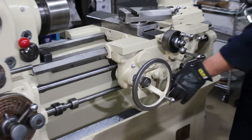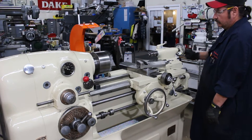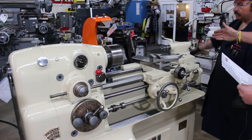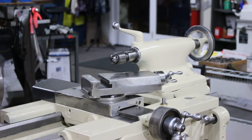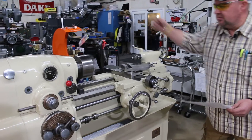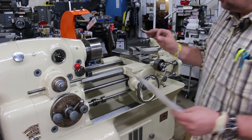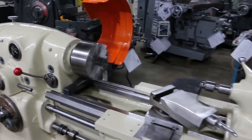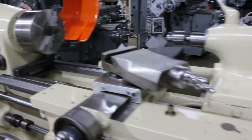Engaging the apron. Engaging the cross slide. Reverse — that's reverse. The tailstock that we're focusing in on right now has a very nice setup on it. It's a heavy-duty tailstock, a heavy-duty wide carriage apron setup. You can tell the sound of this Monarch 10EE is just fantastic. It also has the chuck guard that comes down and a built-in chip pan. The overall weight on a machine of this nature is 2,500 pounds. On a 12½ inch swing by 20 inch between centers, with the weight of several thousand pounds, you have the rigidity and the weight for all the reliability and precision that you'd ever need.